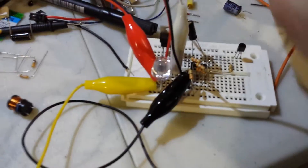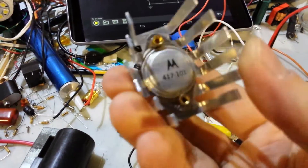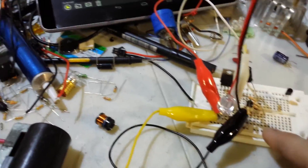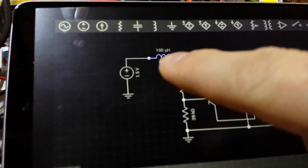Now this is a 9 volt flyback and my transistor did get very, very hot. But you could actually use it with a bigger transistor like this one, which can actually take 15 amps. And the good thing also about this little circuit is your load doesn't need to be on the positive end.